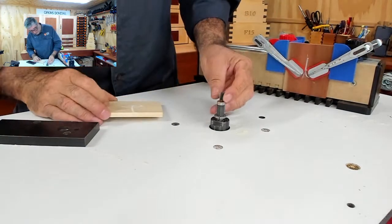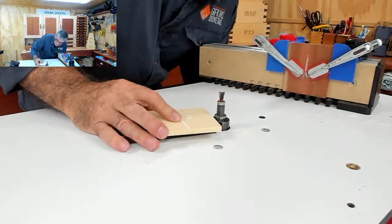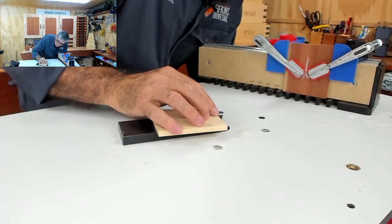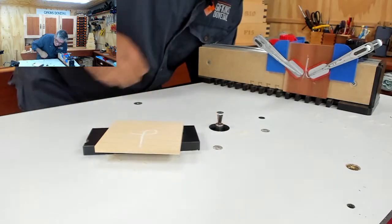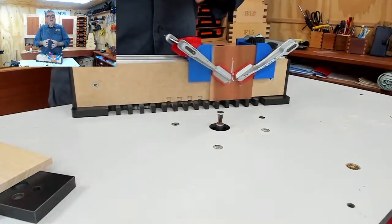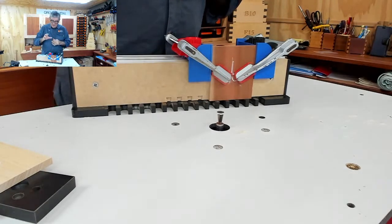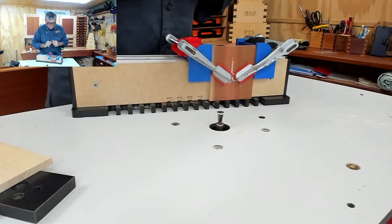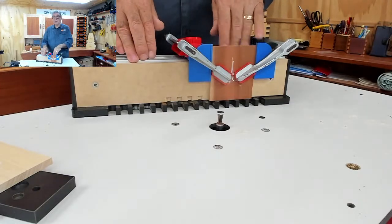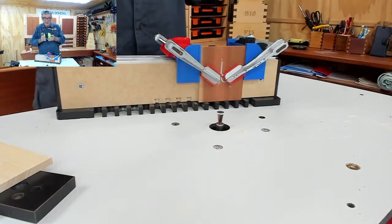So now what I want to do is, I've got my dovetail bit in, adjust my height. Again, that bit's going to go into there. Half a millimeter. You can measure that if you like, but a guess is good enough. Like I said before, the tightness of your joint is not dictated by the height of the router bit. It's the adjustment of the shims that organises the tightness. So, switch off, sound off.